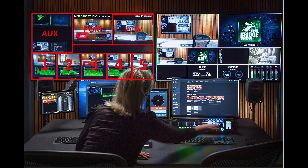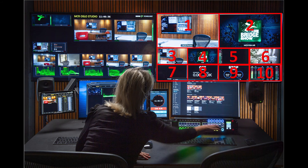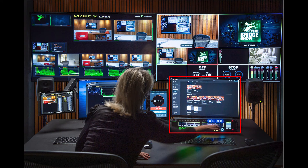The API can be configured to display not only the picture, but also its safe area marker cages, audio level bars, and under monitor display graphics, whereas the multi-viewer display on the right is custom configured for 10 different images. The LVB440 supports NMOS operation, and in this example, an NMOS control panel is being utilized to switch the video sources. The low latency of the Widget API, which is typically less than two frames, now allows facilities to use the SMPTE 2110-20 video streams directly, rather than having to convert them via a gateway product from IP to SDI, which increases the latency and makes them unacceptable for live production.